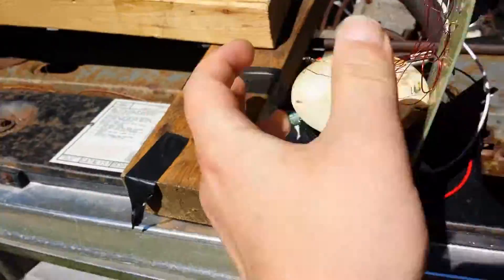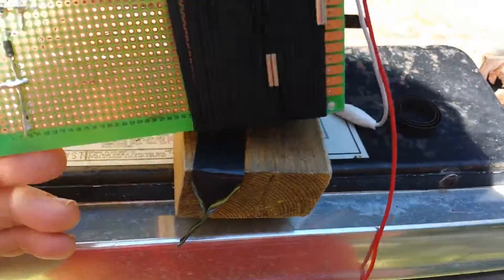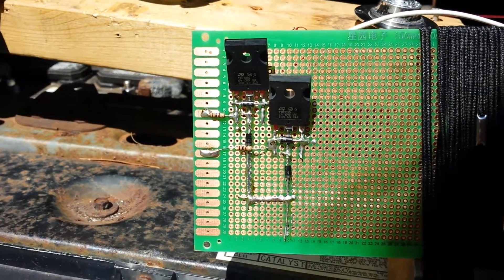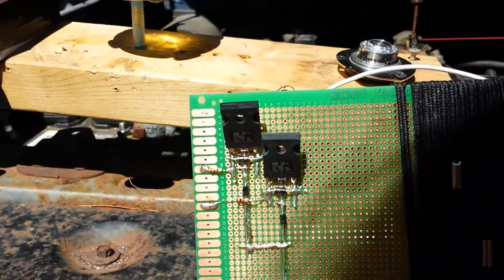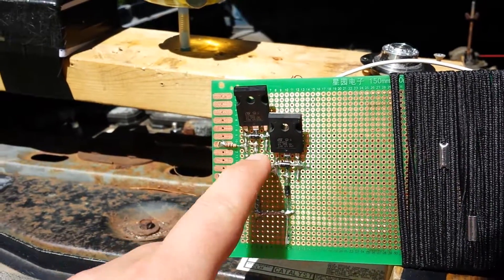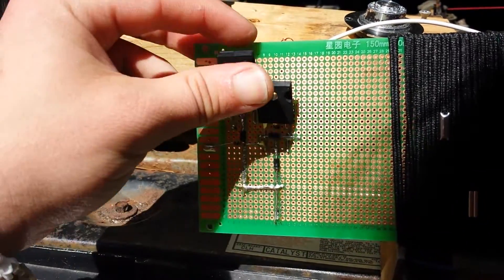What I did is I got two circuits where they're not tied together — they're totally separate except for the input and output. For the input, the collectors have two coils, two drive coils, two trigger coils here and here. And the output, we tie both of those together.